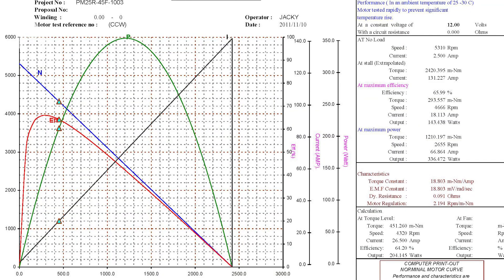Generally speaking, when selecting motors for your mechanism, you want to look at their stall torque and free speed, but also the overall power curve for that motor. Most of the motors we use in FRC have a published motor curve. That curve gives each motor's performance at various speeds. Those curves and any additional data you may need are listed on those motors' webpages. It's important to take these parameters into consideration when designing your mechanism or selecting your motors, especially the available torque.